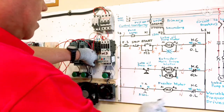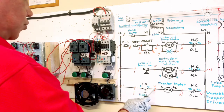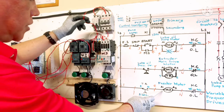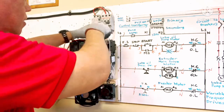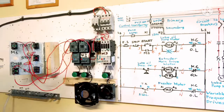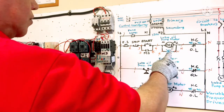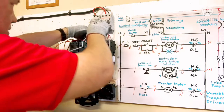This one after. So output timer relay, terminal number 6, we need number 6 wire going to A1. Terminal number 6, wire number 6 is going to A1 M3. This our A1 M3 is here behind. Okay, done. Next is neutral. We need neutral, connect to 96 and 95 to A2. Neutral, connect here.